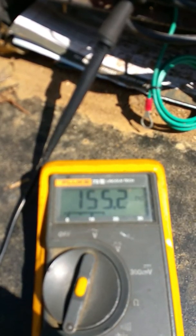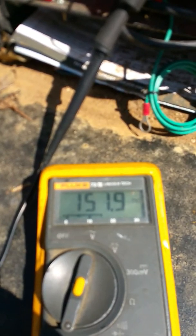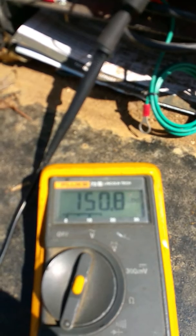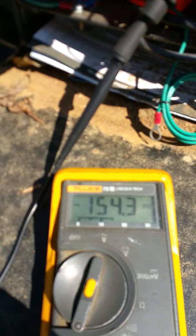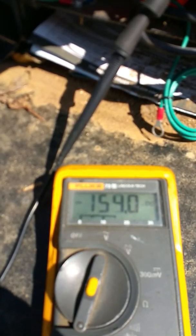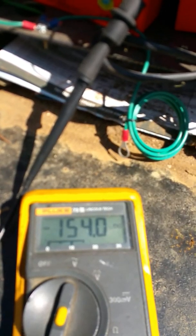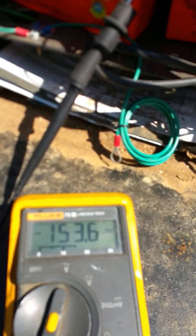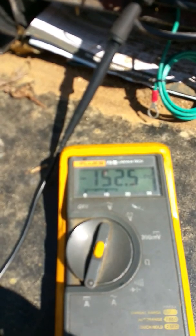When we go 4 or 5 days with no sunlight, the gate dies. At this 150 milliamp draw, over five days the 7-amp-hour batteries go dead. When the sun comes back out a day later, everything's back to normal.